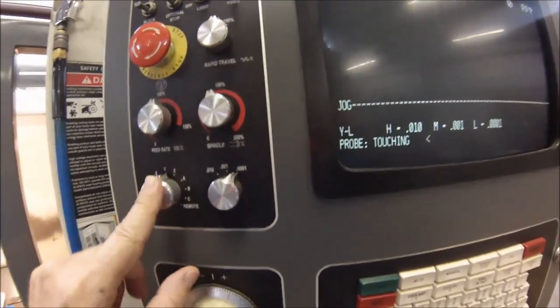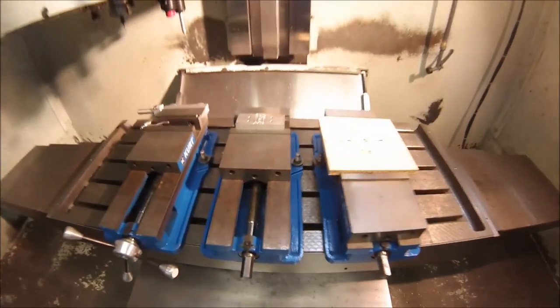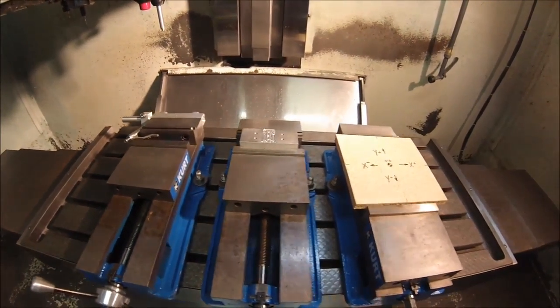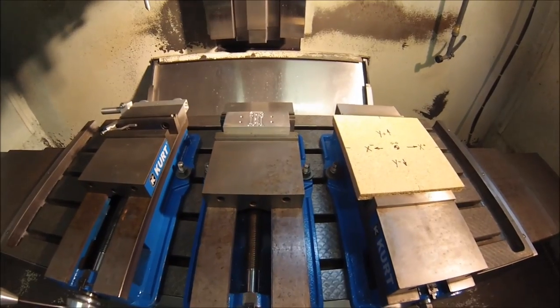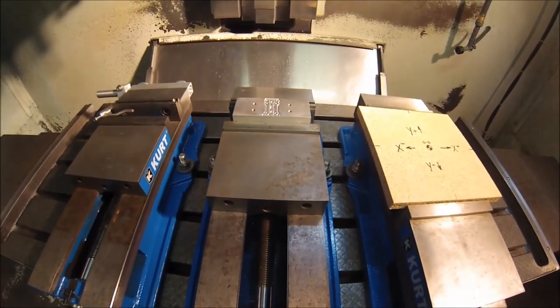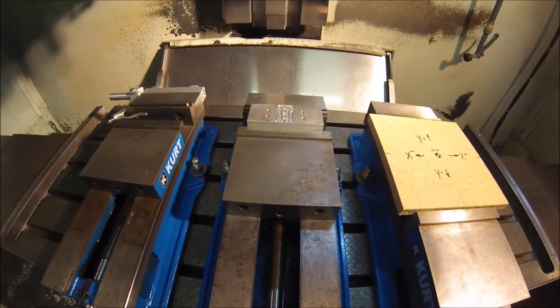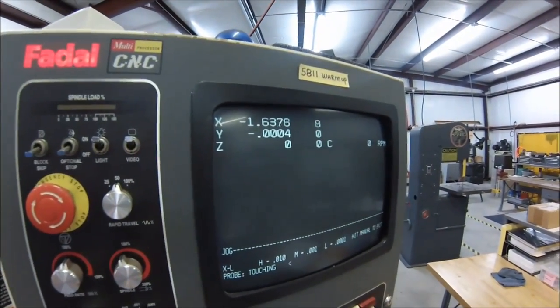Move to the next axis, move the same axis, move a different axis — it doesn't matter, select it here. This is a 10 thou movement at a relatively moderate rate. I'm going to put it on 1 and turn the dial at the exact same speed — you can see it is considerably slower. On a 10th at the same speed, you'll be lucky if you can pick this up with your eyes. Verify on your console — it's definitely moving, just extremely slow.